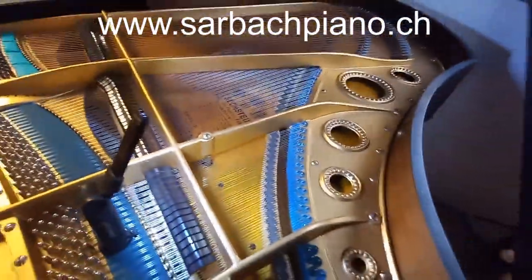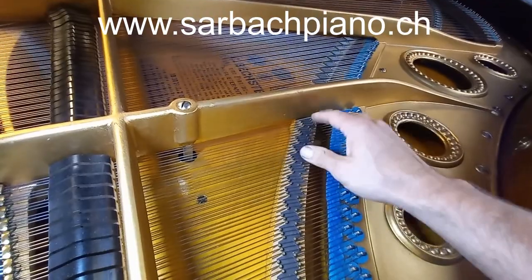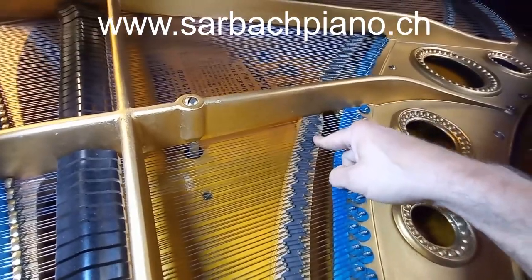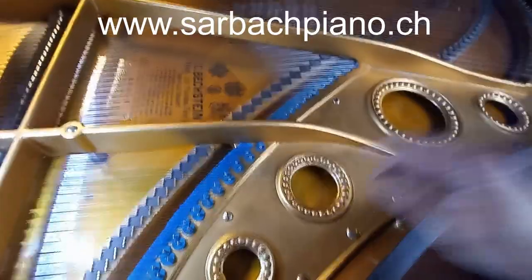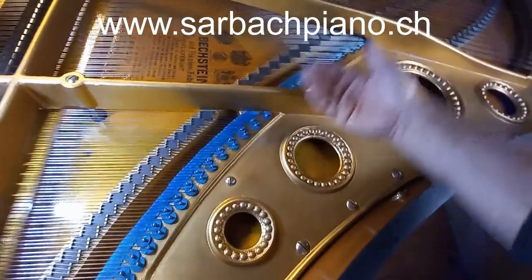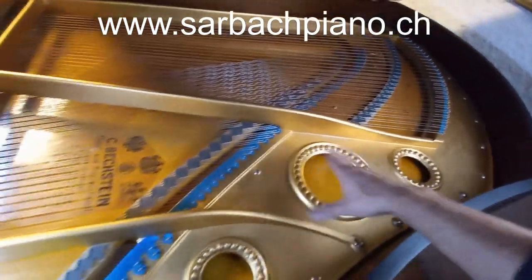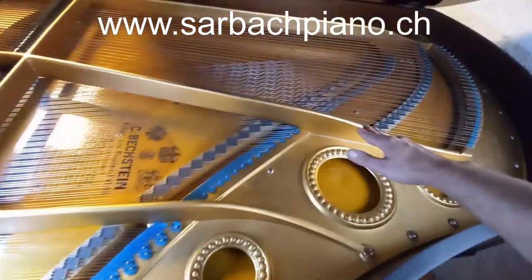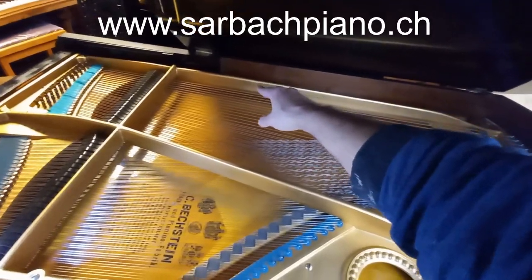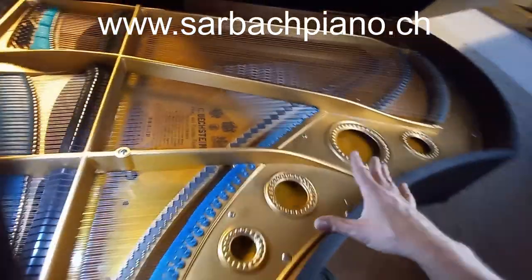In the last video I talked about the bridge pressure. It means the height, about the string pressure on the soundboard. And I show you what I did on this. On Bechstein, here we have some screws and below that there are metal bolts that hold the plate on, and when I screwed off the plate I realized that there's some tension here, so I had to lower these anyway, all of these, and especially there was a screw, this one, that was too high, and so in a process of reducing the plate tension I had to lower it anyway,